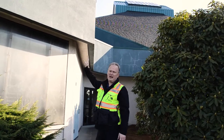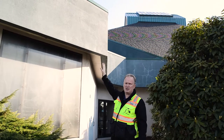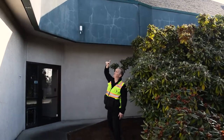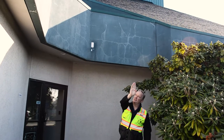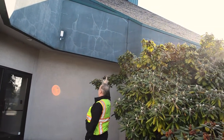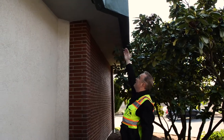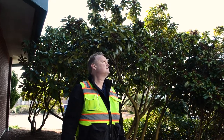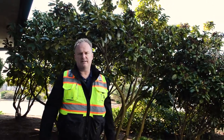Here's a before-and-after: this parapet had a lot of spider cracks and was coated with a fairly simple coating — one step above exterior paint. You can see what it used to look like: very faded, very cracked, with dark cracks starting to grow moss. At the bottom you can see dripping coming off the soffit all the way down to the bark. There's a lot of water running off this face; the stucco probably needs to be restored, but we'll do some moisture meter readings to see.